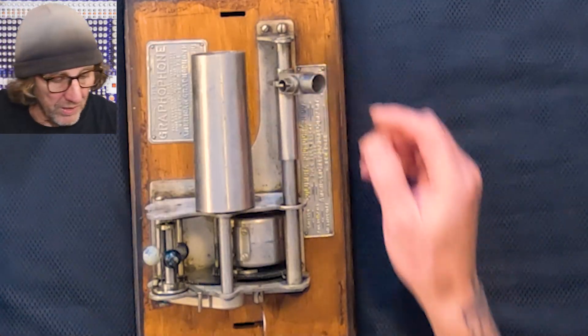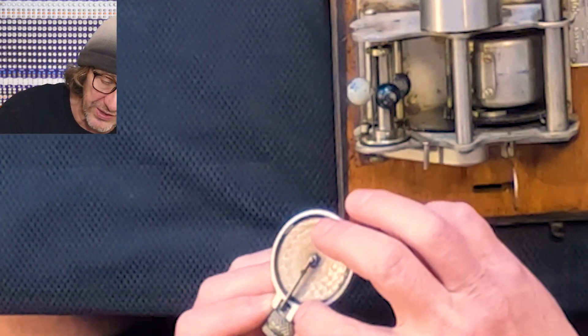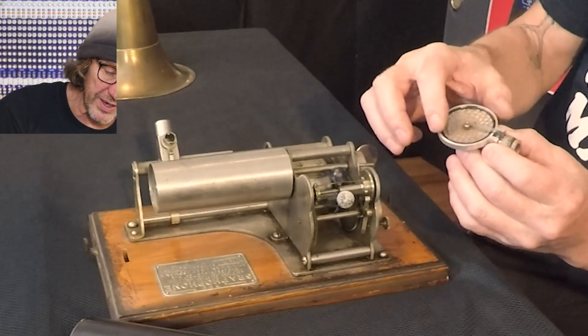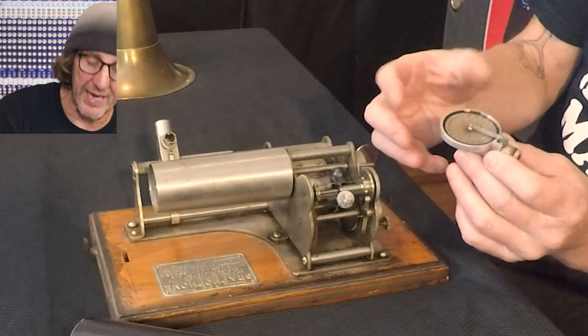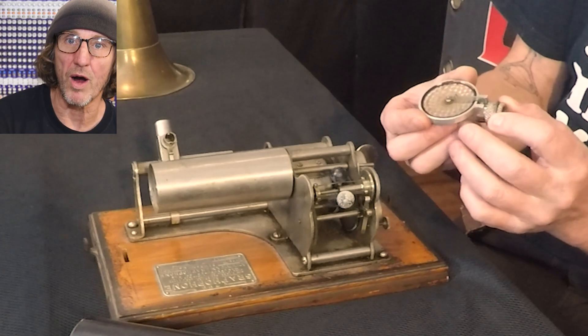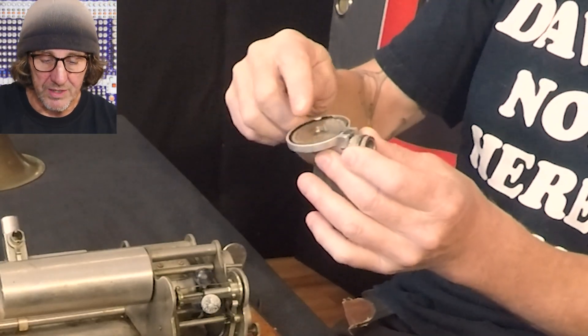This has got some play to it. We can also see that this rubber has deteriorated over time around the diaphragm - it's breaking the air seal. This diaphragm is like a speaker cabinet with an air leak in it. We're going to check that by putting some positive airflow pressure. I can feel air leaking out around the diaphragm. With that air leak, that's going to reduce the sound quality because some of the sound is going to leak out.